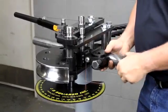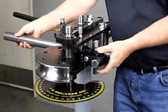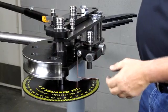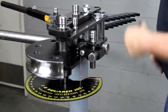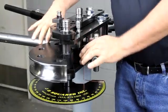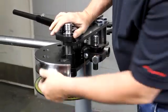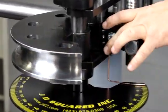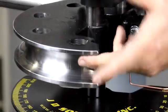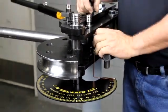The order I like to put them in is obviously the die first. Then we're going to put the U-strap on, and we're going to tighten down this bolt right here. This bolt's purpose is to prevent the tubing from sliding back through the bender as you're bending — very important. If it slides back, especially with thin wall tubing, it's going to wrinkle. The dies are meticulously machined to very close tolerances, our own profile. They are not round dies — they're a specific profile that we determined over the last quarter century produces the best quality bends.